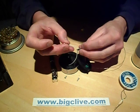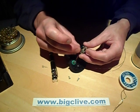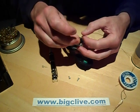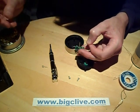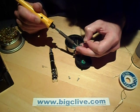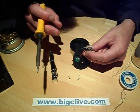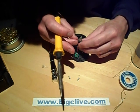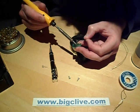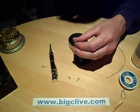The long lead is the positive, so that will go towards the inductor in this particular instance. I'll solder the positive lead in fact. After I've soldered that lead, I'll just make sure it's square - which it is, looks pretty good I think. And then I'll solder the other lead and crop the leads off.